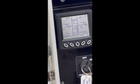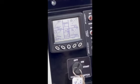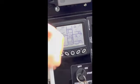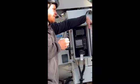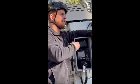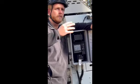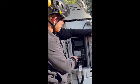If you guys are familiar with diesel engines and how California was working, on the Tier 4s and the Tier 4i Flexes, you had to do manual regens. A lot of guys, majority of industries, not just the tree industry, weren't actually forcing these engines into regens. They were clogging DPF filters, blowing engines up. So now Tier 4 Final engines, it goes into an auto regen, cleans itself off on its own to where you won't even notice it.